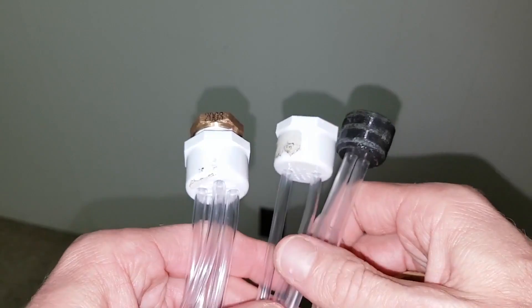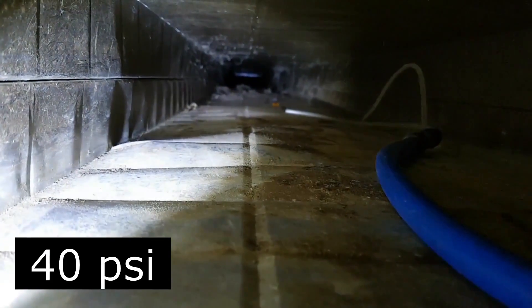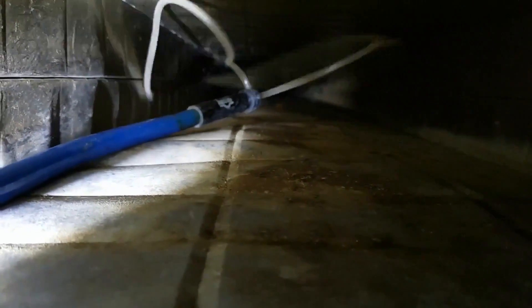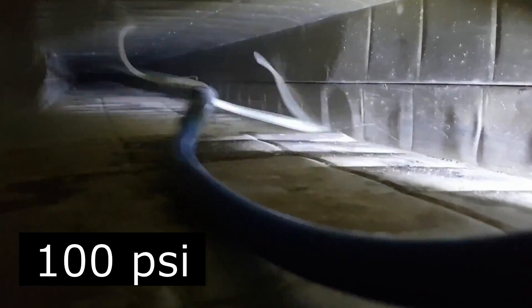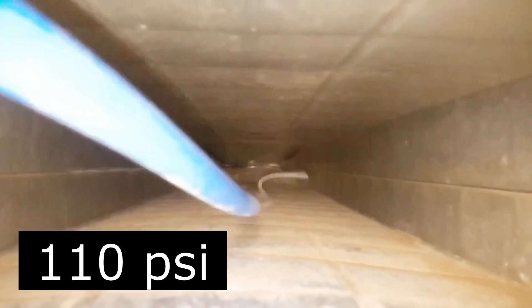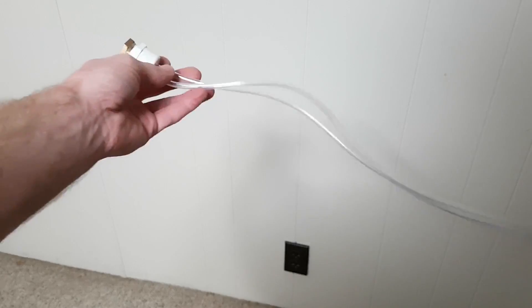Time for some testing. This metal duct is 14 inches wide and four inches tall — definitely going to wear safety glasses. It takes a constant 100 psi to get good results with this size of whip. I'm going to show how the tubes of this whip twist together. Shortening the tubes to 12 inches or less fixed the problem, but now the whip requires more air to operate and has less coverage — does a good job though. Spacing the holes in the cap further apart, like this PVC cap allows, should reduce or eliminate the twisting problem.